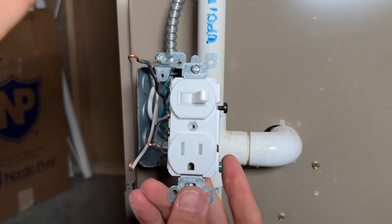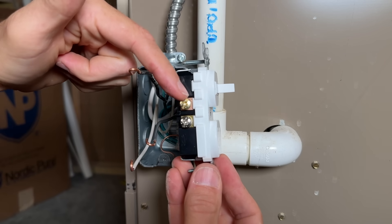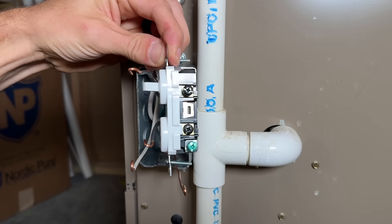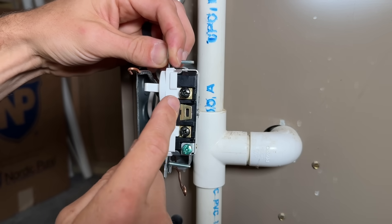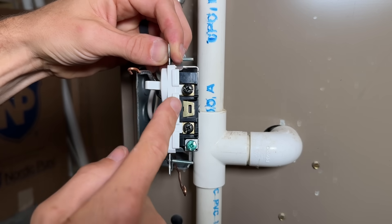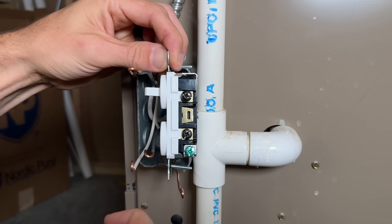The wiring is a little different with the combo unit. On one side connect the hot conductor from the metal clad — that's the power coming into the circuit. The neutral goes to the silver screw terminal, and on the other side you provide the switched power. Bring the hot conductor from the furnace here; keep the tab in place so the outlet also turns on and off with the switch — the tab makes the connection between the two outlets. Removing the tab would be needed for the emergency power scenario. Since I want both top and bottom to act the same, I tighten into that screw terminal and leave the black screw terminal unused.